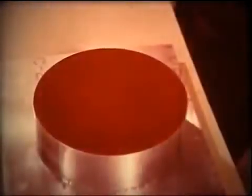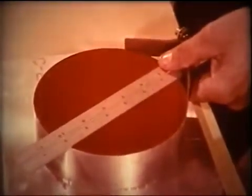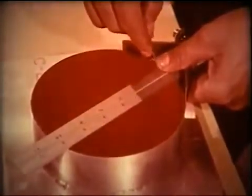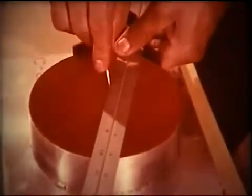The technique is the same for cylindrical work. Position the faces of the head firmly on the circumference of the cylinder and scribe the diameter. Move the tool to a new position and scribe a cross line to find the center.